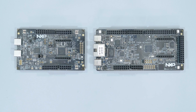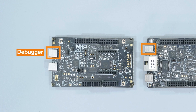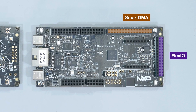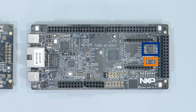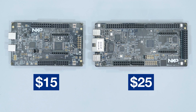These boards have a variety of connectivity. They have NXP's FRDM header, an Arduino-style shield connector, a socket for MikroBus, and an unpopulated PMOD port. There are two USB-C connectors — one connects to an onboard debugger and the other is a full-speed connection to the microcontroller. The MCX-N adds headers for a flex I/O LCD, smart DMA camera, CAN bus, an Ethernet port, and on the back, an unpopulated microSD card footprint. The board also has a temperature sensor, external flash, and a capacitive touchpad. Depending on where you buy them, these boards are in the $15–$25 range.